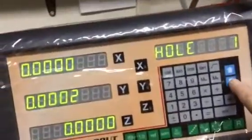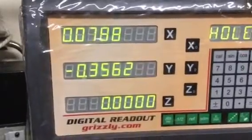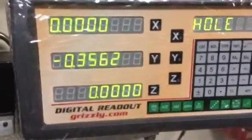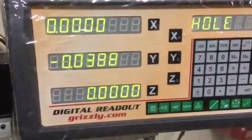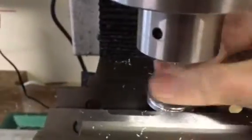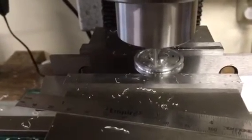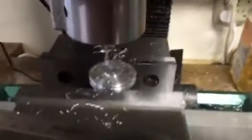And now we come over here to hole number two. Now you can see it has given me two new coordinate sets, so we're going to have to go back the other way. Basically you're just going to zero-zero for each one of your hole positions. So I've got to also move the Y — I'm scrolling that in to zero. And there we go. It has moved around counterclockwise, which is the way it's going — I can never figure out which way it's going to go, but that's the way it does it. And we'll do another hole.